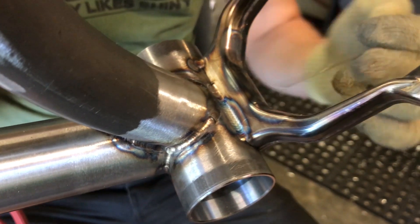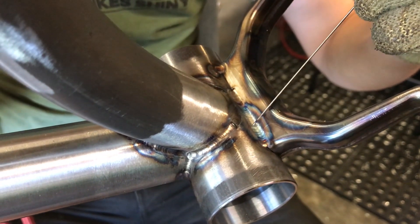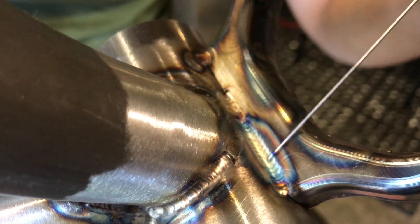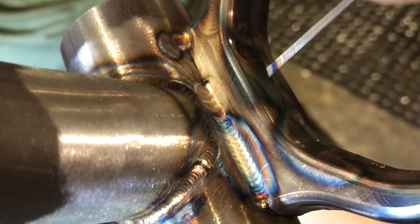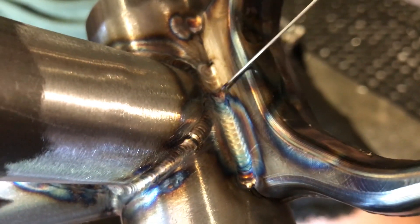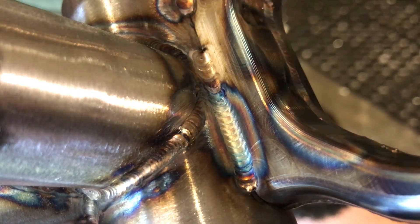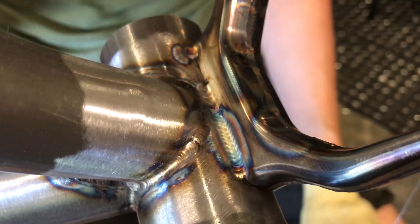It's interesting when you're welding bikes — everything has a curve to it usually and you never get a straight section. This is like the only straight section I've ever welded on a bike anywhere. The bead spacing is perfect through this little stretch — it's incredibly consistent, which I'm not used to. We got into the inside of this piece where I think there's a little bit more material, and then I came across this other weld puddle where my cup is getting closer to some stuff and my arc length got longer. So here it gets a little bit less consistent, but through the straight stretch it just looks exactly the same, dime after dime. You just don't get that on a bike — you're always changing your torch angle and wrapping around things.